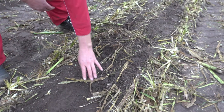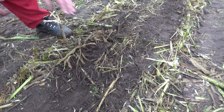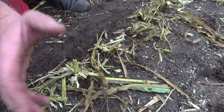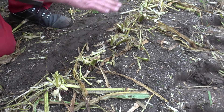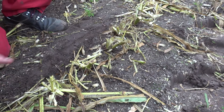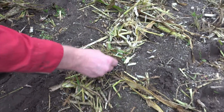That's why you should always adjust the pressure according to the soil conditions — whether it's sandy, loamy, or heavy soil. Here we have driven with an operating pressure of approximately 3.8 bar, and now you can see the hoods do not slide, run nicely over the ground, and the stubble is really broken up very well down to the node, as it should be.